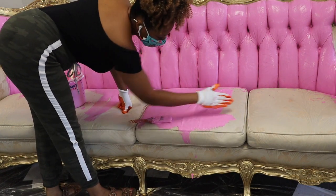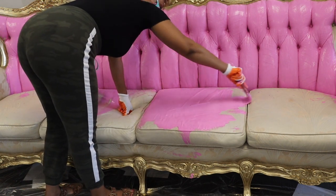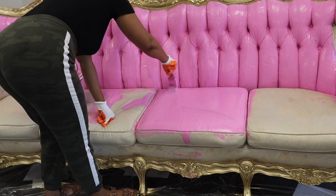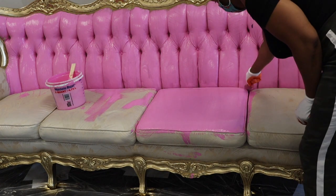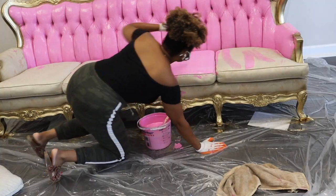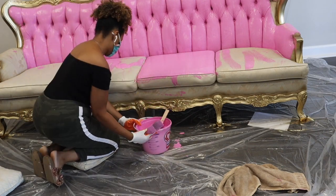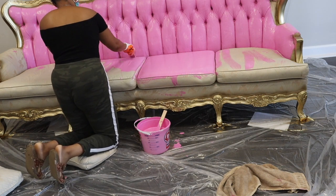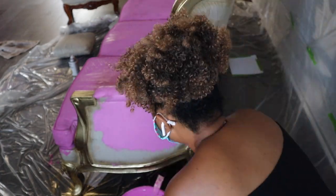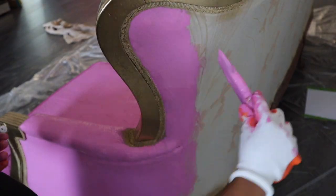Until I reached a good consistency and was satisfied with the coverage. Paint has a tendency to crack if applied too thick and may also flake over time, so you definitely want to use thin coats at first. This fabric has a slight texture, so you want to paint in the same direction and work quickly to avoid brush strokes. I know the irony is that you can see me painting in all directions, but I'm going back and painting everything in the same direction. Also, if you have a chair with darker upholstery or a bright obnoxious pattern, you'll likely need a darker color or more coats — since my sofa was white I didn't have to worry about that.